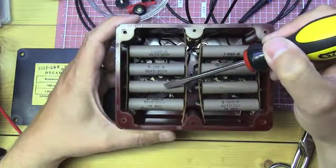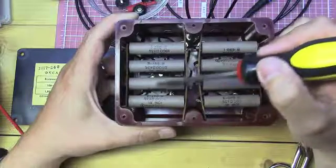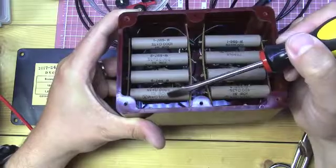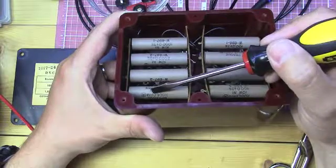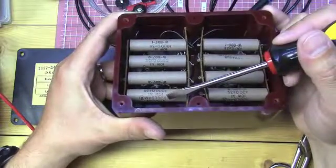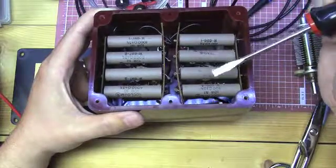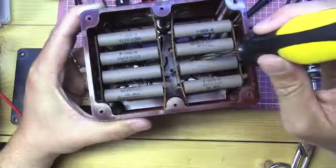You could drop this off your desk and it'd probably survive. Inside you can see some of the resistors: a 1000 ohm, 2000 ohm, 3000 ohm, and 4000 ohm — all 3% resistors. The brand is Sprague and it's called the Kool Ohm — K-O-O-L-O-H-M — apparently a trademark brand. On the other side you have the 400, 300, 200, and 100 ohm resistors, all 3% and all 10 watt.